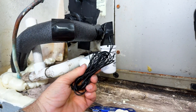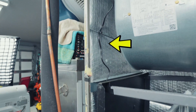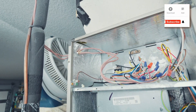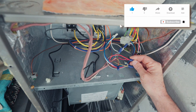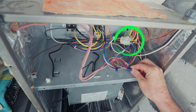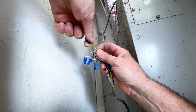Now we'll go ahead and stretch out our wire right here. Normally these wires go inside the unit, but not on this one. You'll want to route that in a very careful way away from any sharp edges or moving parts, and also make sure you have the power turned off. If you take one of these wire nuts off and short that to ground, you'll burn out the transformer that's in the back of the unit. So keep the power turned off when you're doing this — you'll be a lot safer.